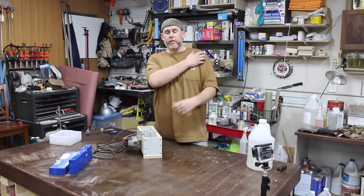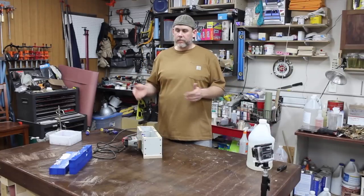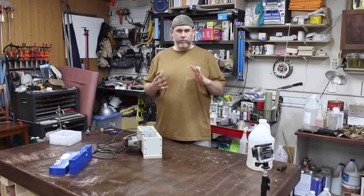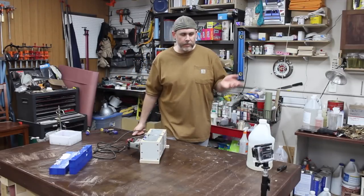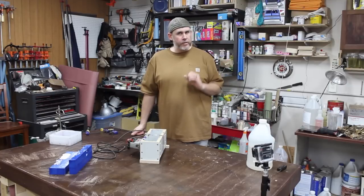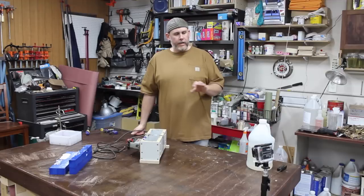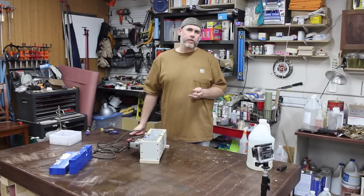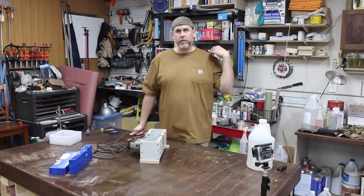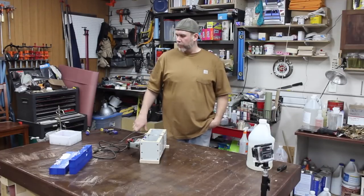He usually does wood, so he needed 3" by 3" by 12" blanks made out of some kind of resin. I generally use Alumilite, and especially for something like that, it's not just turning. He does some machining on these things, and I wanted to use Alumilite because it machines better generally than epoxy or polyester resin, and frankly I just don't really cast with those two materials anyway, so this was a little bit more comfortable for me.